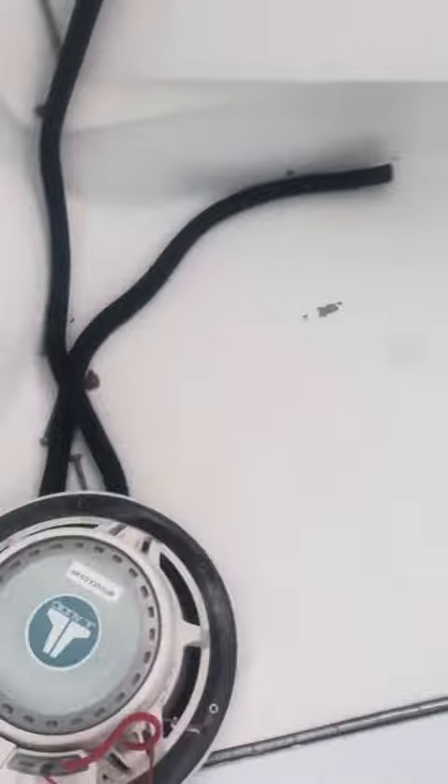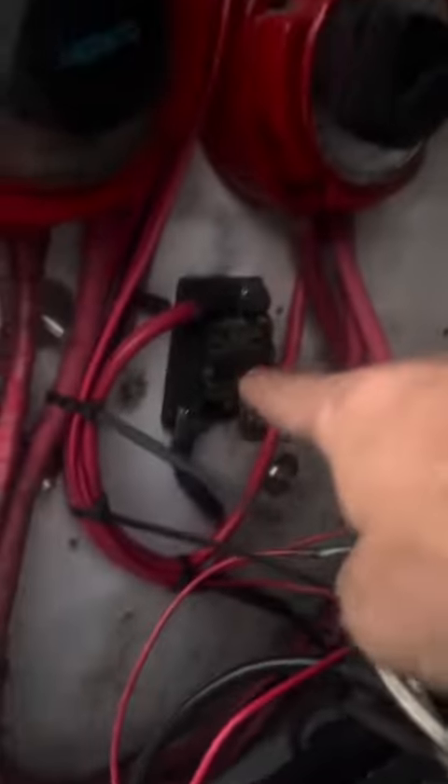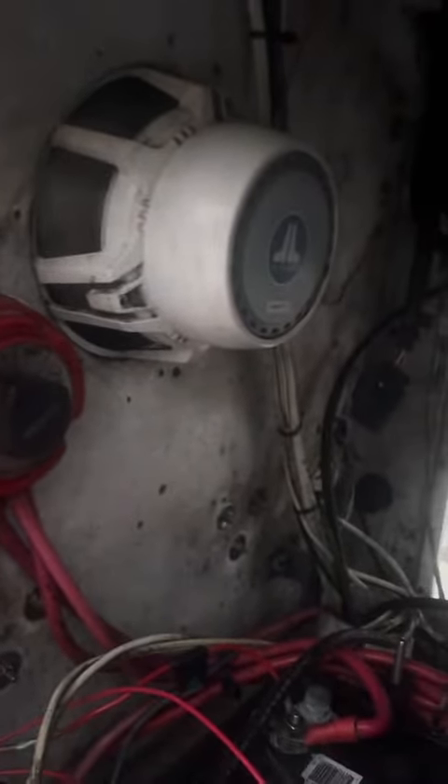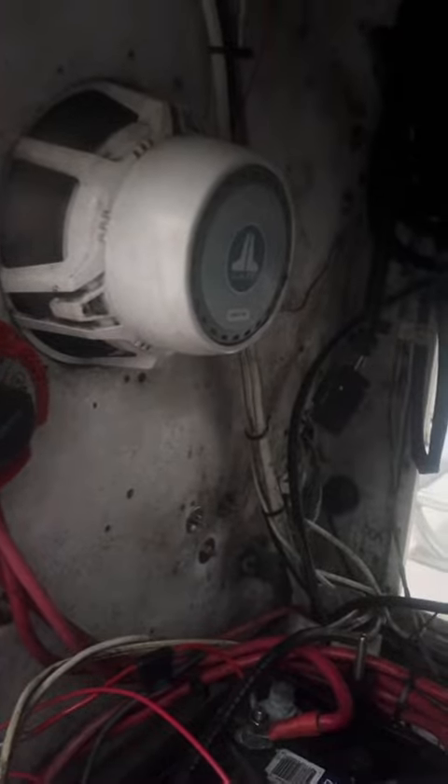Don't see too many of these things do that, but if you don't take care of your stuff, that's what you get. We rewired the amp up and put a nice breaker for it. We also had his float switches wired straight to the battery switches where, when they're off, the float switches weren't working. We always put them straight to the battery with a fuse.